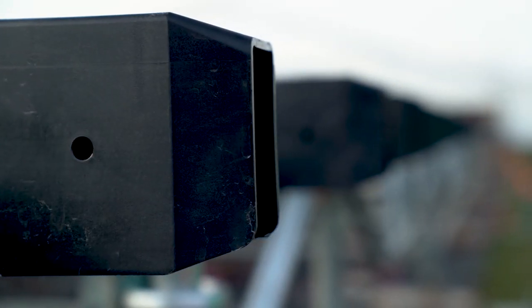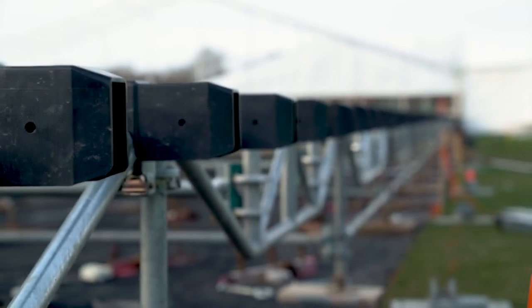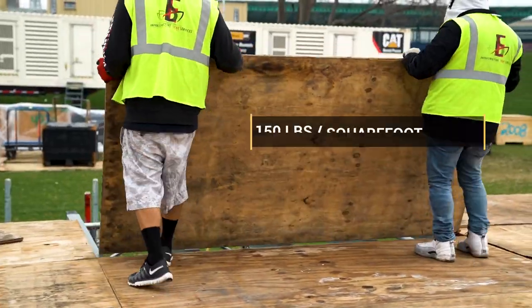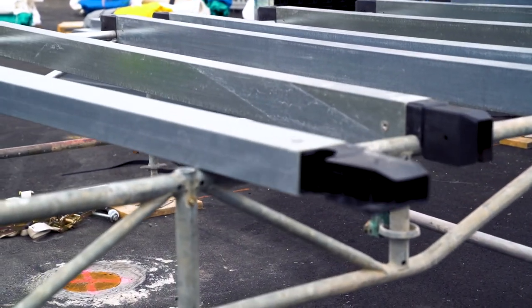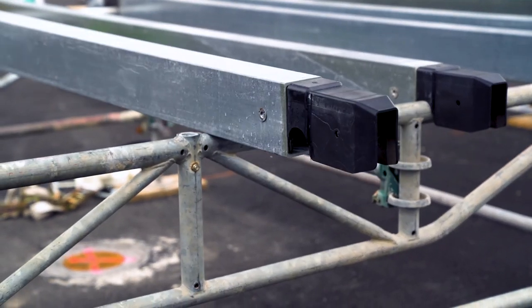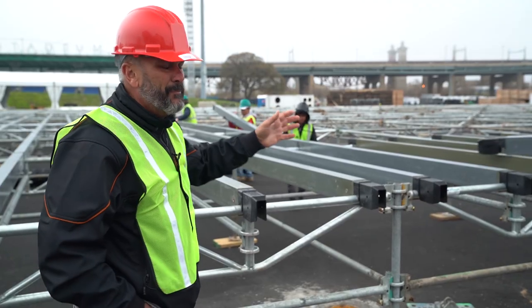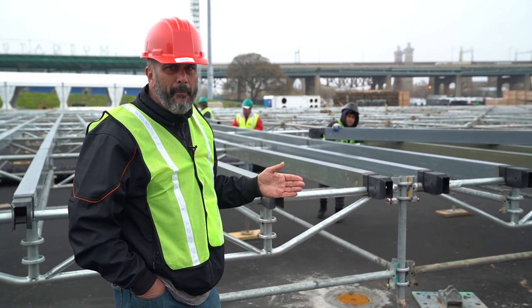In this case we're coming down and we have a two-foot spacing on all of these beams, which gives this connector in composite with wood a 150 pounds per square foot rating. As you can see right here, they just pop the end in there, slide it right to it, and boom — drops right on down. The speed at which this beam goes down is tremendous, which also cuts down on the measuring time.